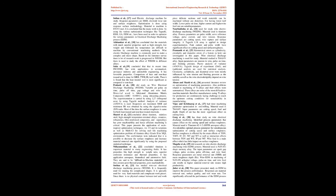Kumara and Ravakumar et al. [12] did optimization of the parameters of wire electric discharge machining (WEDM). Input parameters are time on, time off, wire speed, and wire feed, with three levels selected for optimization. Responses selected are metal removal rate and surface roughness (RA). A quadratic mathematical model (RSM) is used, and graphical representation is used for showing the influence of parameters on selected responses.